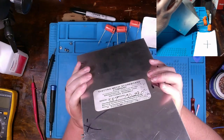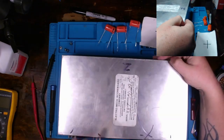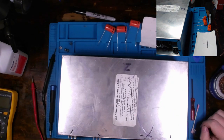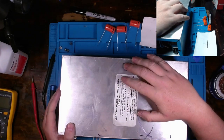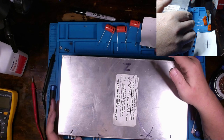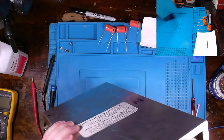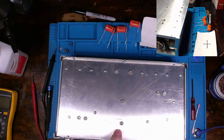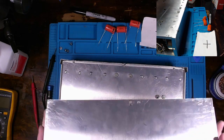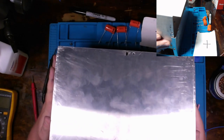Now, what I had to go through on two of these modules was identify substitute replacements for the relays themselves, because they're no longer manufactured. I wrote annotated notes on there in case they ever have to be replaced again. And then troubleshoot to figure out why theirs was malfunctioning. I'm going to finish putting this one back together. But it was primarily due to some capacitors in one of the boards that had blown a fuse in this guy that needed to be replaced.